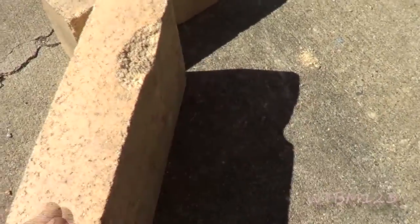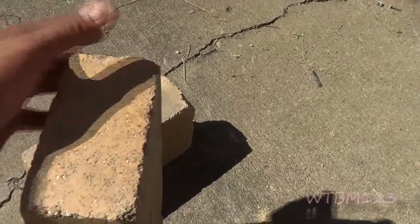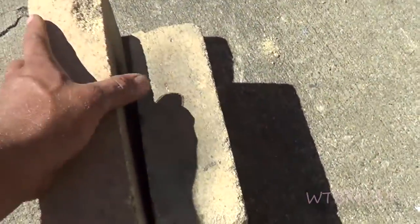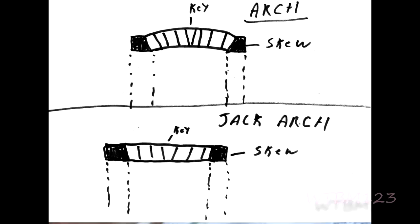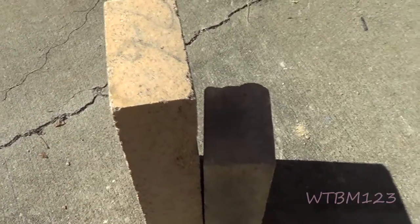You can also take and cut at an angle, and you'd end up with a wedge because that would be the long way of the brick. If you was to take it on the side and cut it at an angle, you'd end up with two arches. There is a combination of bricks for that whenever you do like a dome or something. If you had a bunch of wedges, you could make an arch. Same thing with the arch brick — you could make an arch. And if you had that arch and cut the bottom and top off to make it flat, that would be called a jack arch. The little corner brick on an arch is called a skew.